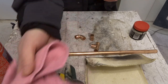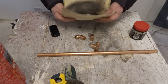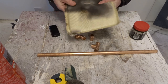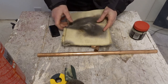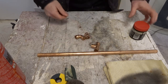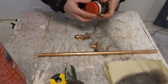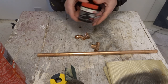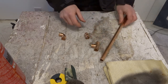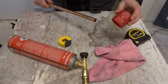You're going to want a rag — any rag will do. A tape measure, but that's optional dependent on the job you're doing. You might want a heat proof mat — basically if you're doing something under a sink or between some joists, you don't want to catch anything alight, so this is quite important and you can solder pretty much straight onto it without causing any damage. A lighter in my case because I'm not using an auto-lighting torch. You'll also want to grab yourself some flux — get yourself a lead-free flux of any kind; this is a self-cleaning flux. And of course you're going to want some copper pipe and whichever fittings you need. I'll put a link in the description for a lot of these handy plumbing tools.